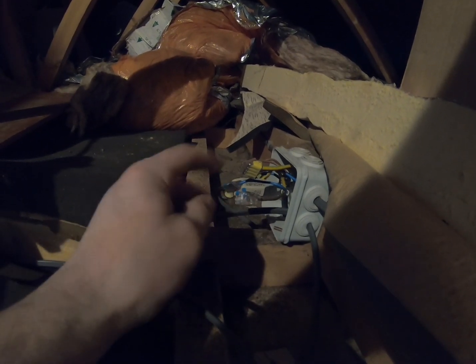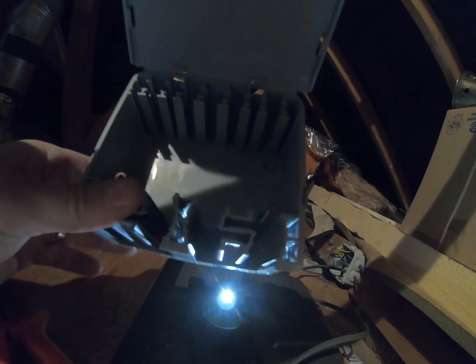Just a small adaptation to this one. We've disconnected the supply to the switch which went this way, put this in which is going to be the supply into the receiver, then we're going to have a bit of cable going back which connects to this and the new neutral — everything goes down to that light. So just a very quick adaptation to this circuit here to install that, pair the switches to the receiver, and the job's done.